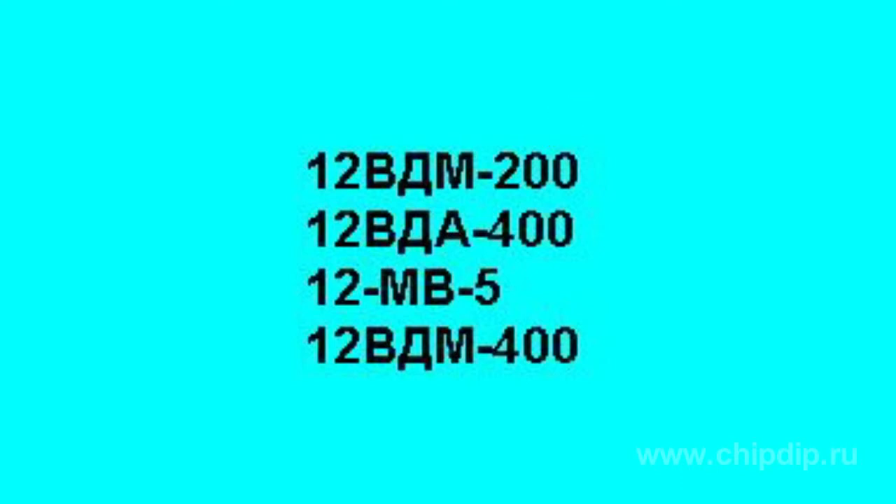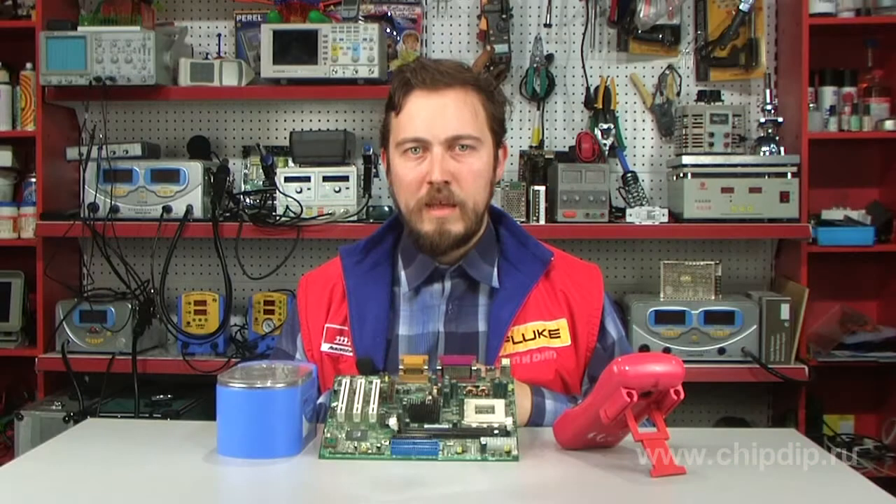A 3 to 12% cooking salt solution is used as the electrolyte. Due to the simplicity of construction, the air-metal mechanical recharge batteries serve as a reliable voltage source provided there is salt and water.